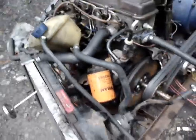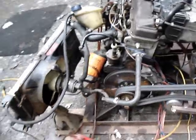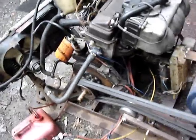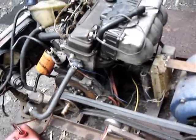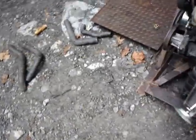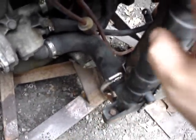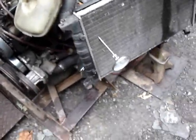I've just been kind of running it and mainly worrying about the engine, seeing what the engine is going to do. So far it's been coming up roses. Yesterday I ran it and it was coming up to 190. Well, it came up to 180 and then the thermostat opened — you can tell, because this bottom hose will heat right up. Right there is your thermostat, and it's coming out this way, up through the radiator and back into the engine. That hose will heat up once your thermostat opens. So it got up to 190.